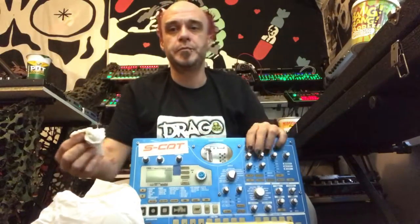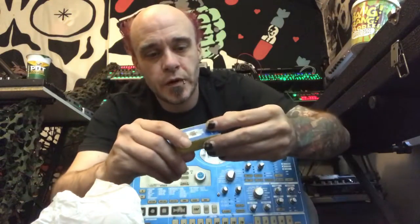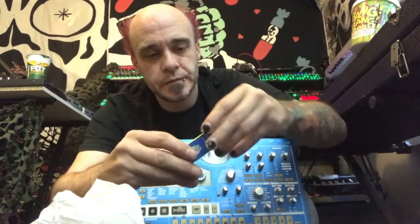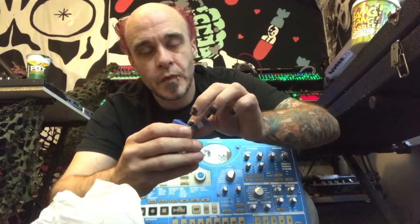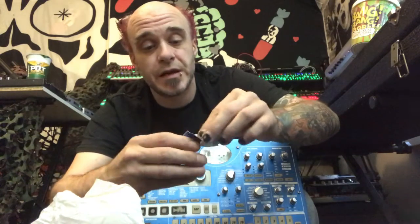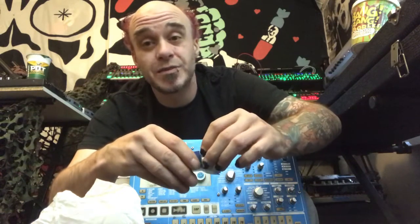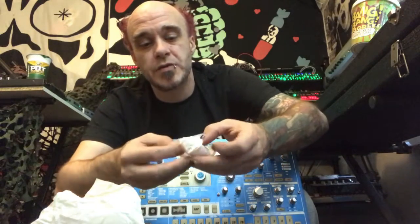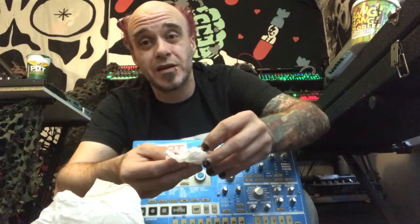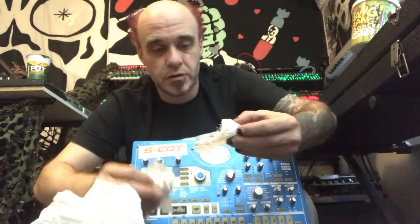Yep, let's say that one was in. Let's get the other one out. These tubes have been passed. It came with a pass and balanced. That's another thing. I've never had to adjust the balance on any of the tubes I've ever put in. Saying that, chances are this time I will.